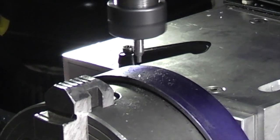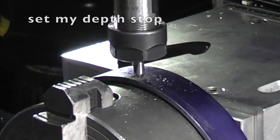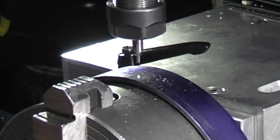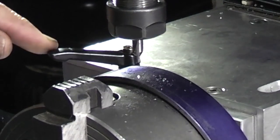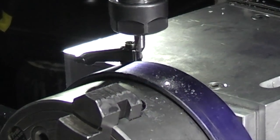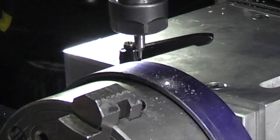At that depth the drill has just come through and it's a tenth of an inch from hitting the chuck. I think that's deep enough — a countersink for the plunger to line up on. If I slacken off the clamp and index it, I want to put 24 holes around there. I'll index it to the first position and see what the gap is between the holes — I need to move 15 degrees. That's the spacing, so I'll lock that up there and drill the next hole.